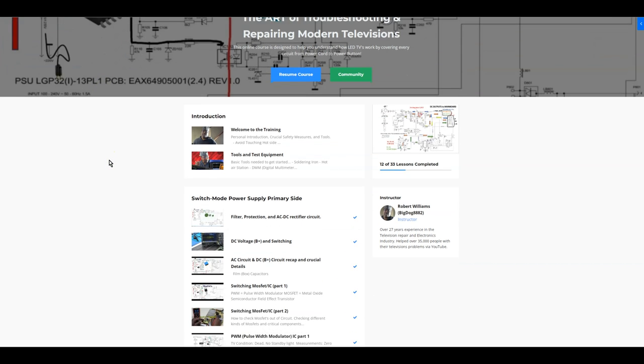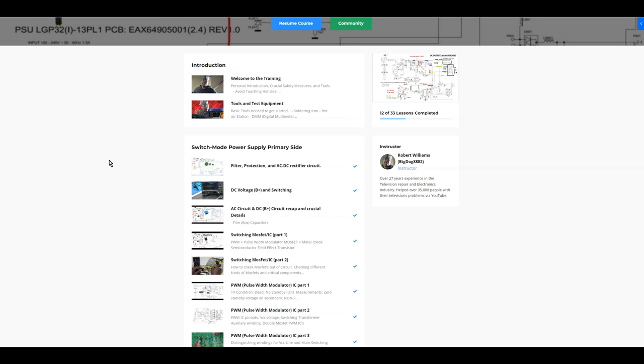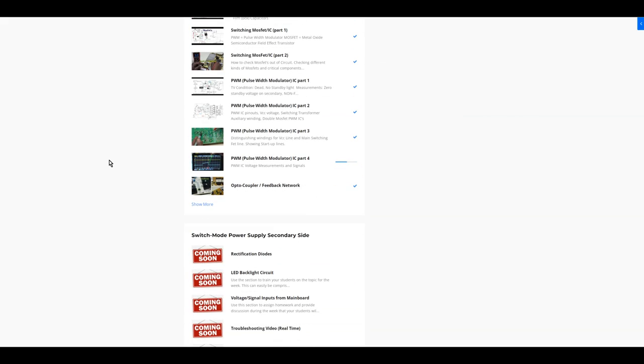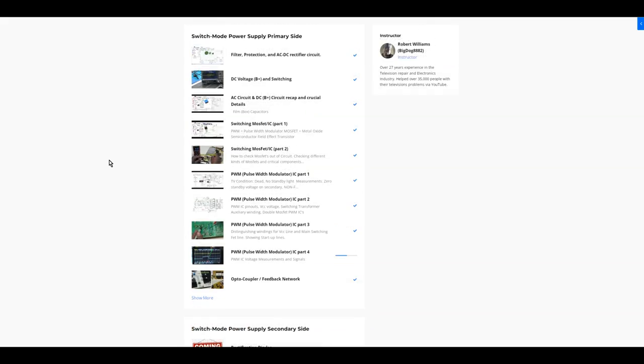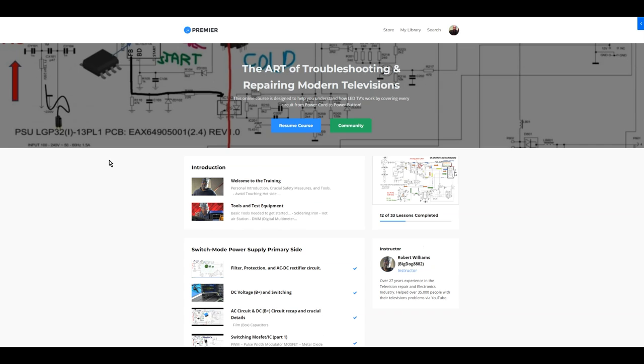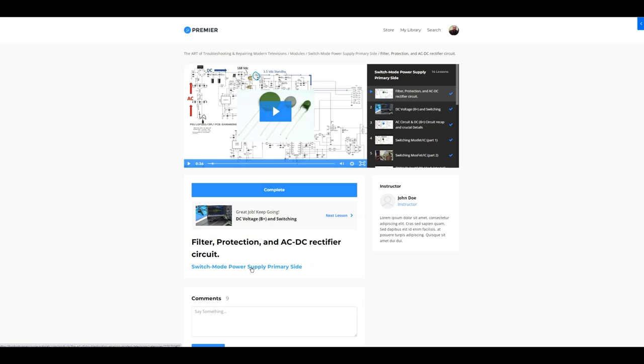So I'm just going to talk about myself, and I know there are a lot of other technicians who are in the same predicament. Even though I've been working on televisions for 30 years, it'll be 30 years next year in 2024, when it came to a power supply board, like if I had a dead set, anything past checking for shorted MOSFETs, swollen capacitors, bad solder connections, or checking voltages like the standby voltage, I didn't know anything past that. So I would just order the whole power supply board.